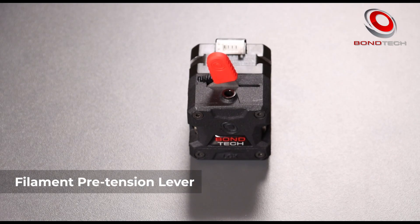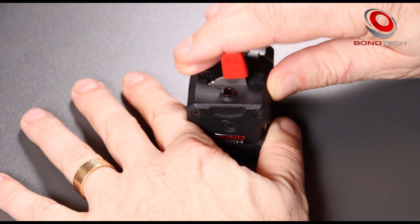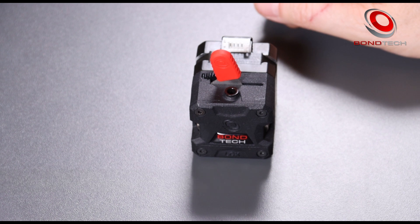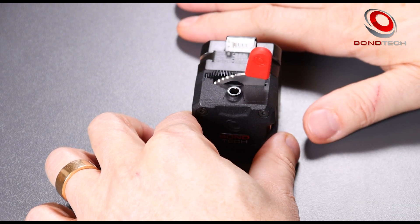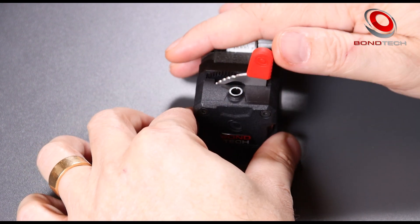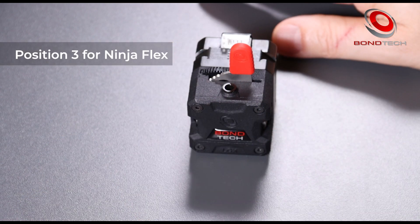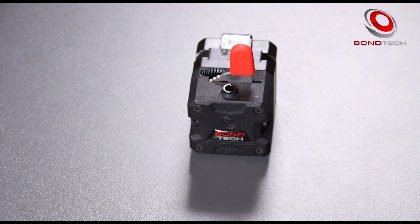Here at the top we have the pre-tension lever. The pre-tension lever has six presets. All the way to the left, the drive wheels do not engage the filament — this position is for stress-free load and unload of filament. To the right there are five more positions for several tunings and material types. In principle, the softer the material, the higher position you will need. For instance, we use position 1 for PLA, position 2 for semi-flexible filament, and position 3 for NinjaFlex. Find the setting that best works for your setup and material and keep using it for repeatable results.